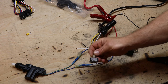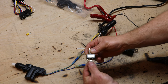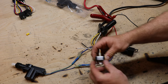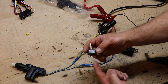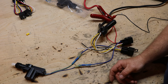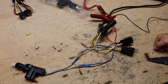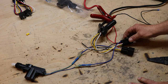Right now we are just in test mode. For those who don't know, a momentary switch is off and centered all the time. The power wire — the fused wire — will be in the center, and when you tip it one way it makes connection on one side, and the other way it makes connection on the other side. This is very common in hydraulic lift on your outboard or hydraulic trim. If you've got a CMC hydraulic trim, you'll see there are two relays underneath the back of your boat wired exactly the same as what we're doing here.